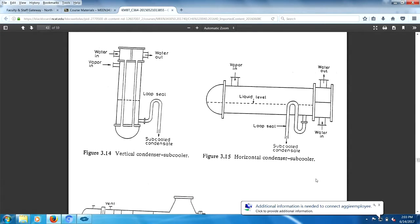There you go. You have a loop seal. I hope you understand how a loop seal works. Any liquid that's up here will fall over due to gravity, right? You know, gravity works this way. So the liquid in this tube would be right here. Anything more would flow over. So what that means is the liquid inside here is the same level as that right there. That's called a loop seal. You have these everywhere in your bathroom and kitchen sinks.